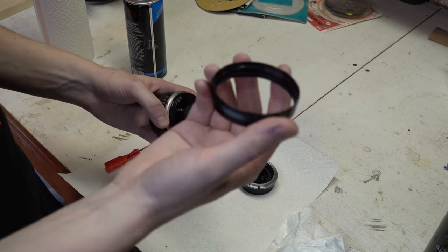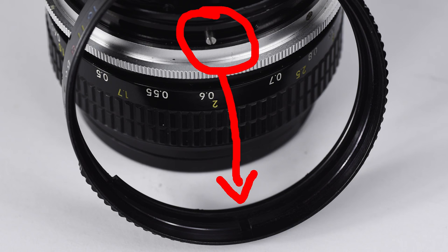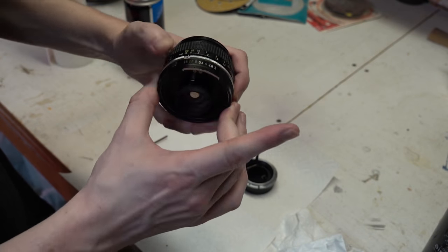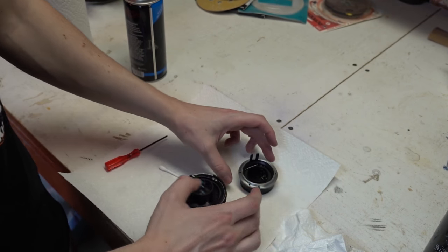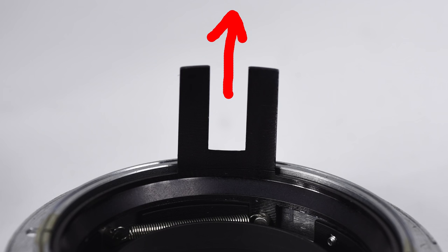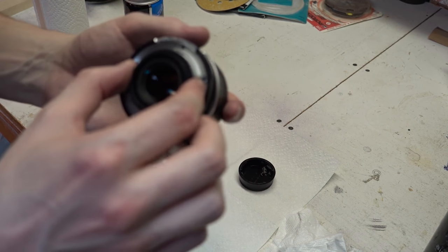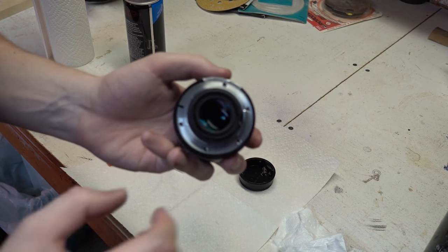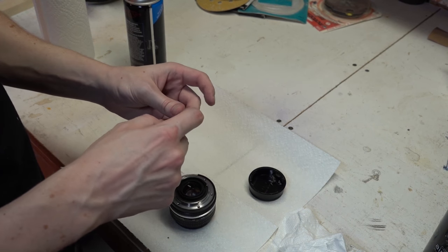To get the aperture ring to line up correctly - there's a small notch on the inside and there's a little pin here. This notch is going to have to line up on this pin. To test, I'm going to turn it - it lines up with 2, lines up with 16, so I know the aperture ring is installed correctly. Then we're going to put the back plate back on. There's a small tab right over there that's going to fit in the middle of this. I slide that into place and rotate until all 5 screw holes line up, and I'm going to take the screws.